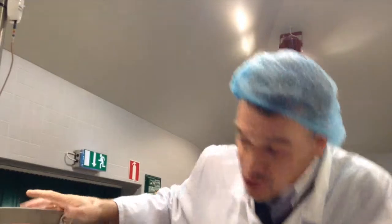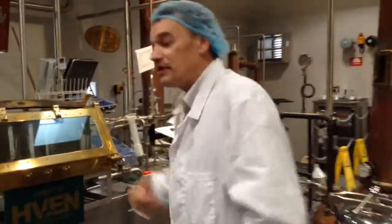Okay. So, of course, after the fermentation, we're bringing it over to distillation. And generally when we do the whiskies, we distill it twice. First distillation, of course, is mainly taking away the harmful components like the ethyl carbamate, the sulfur component that we could create over fermentation. Of course, water and solids, yeast components, flour, whatever. We bring it up from about 8.5% alcohol up to about 25% alcohol.